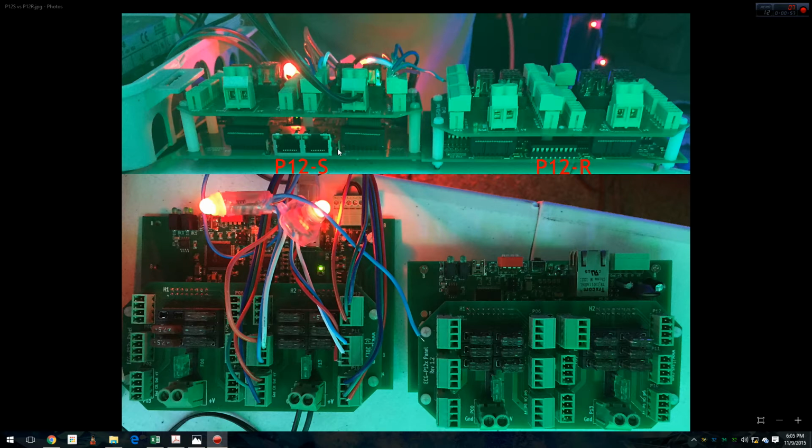So you'd hook up your crossover cable directly to one of those Cat5 plugs, and the other end of it would go straight to your first LOR controller, and you could run your LOR controllers in DMX mode. The crossover cable is important in that configuration, so don't forget that. I think Clyde Lindsay has a great video on how to make a crossover cable if you're not familiar with how to do it.